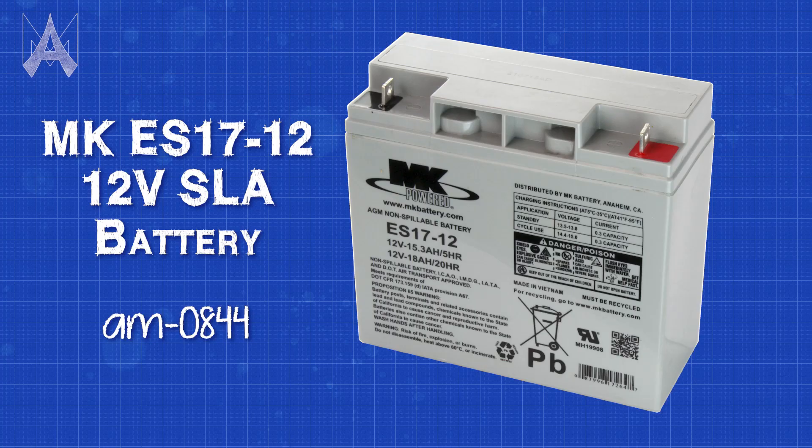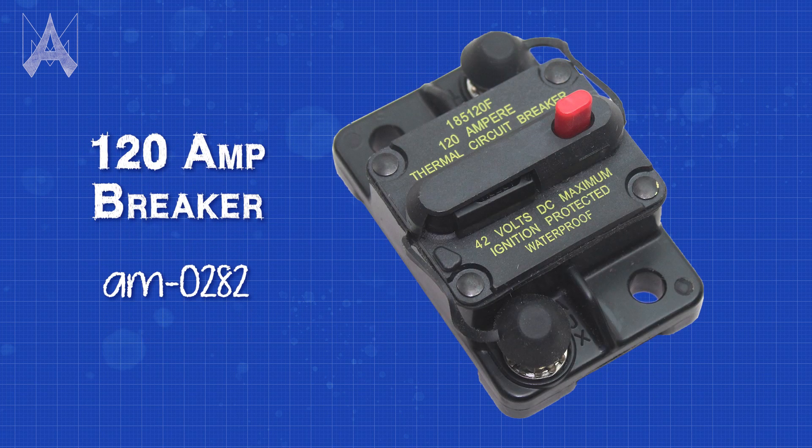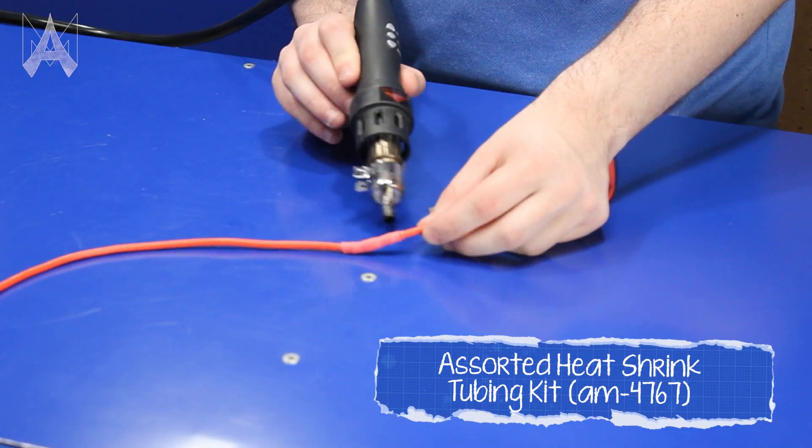The fourth and most important section is electrical. Many of the electrical components on the robot are heavily regulated. There's a list on the FIRST website specifying exactly what part numbers and model numbers are allowed for many of the various components. All of your electrical devices should be easily accessible and visible — for the robot inspector, but also for troubleshooting your electronics. When it comes to batteries, only a single 12-volt lead acid battery is allowed. The main breaker must be easily accessible to easily power on and off the robot. When wiring your robot, make sure you use the correct amperage breakers for your application, the correct gauge of wire, and all wires must be of specific color as specified in the rules. There are some exceptions if the wire is manufactured with different colors, and you can always alter the color of the wires using colored shrink tubing.